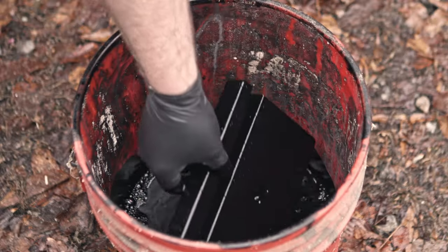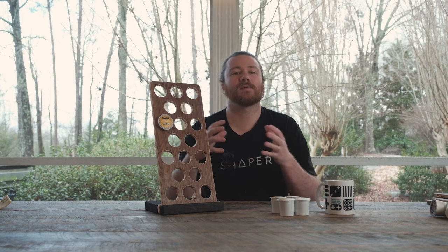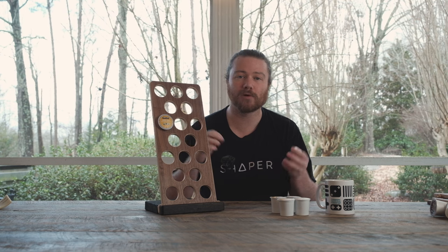And one of the things that I do want to caution you about, if you saw the white oak ones in the past, white oak and red oak accept stains and dyes just in a completely different way. And that's just how they're built up and their grain structure and how porous the material is. Specifically with this red oak, after I dipped it down into the India ink, it had a really nice black finish, but the longer that it sat out and the more that that ink was exposed to the top grain, it started to expand and it started to expose different pores in the grain that didn't accept the ink, which is very easy to combat. You just go back with a second coat, or as you're wiping it off, normally that's going to fill in those areas easily.